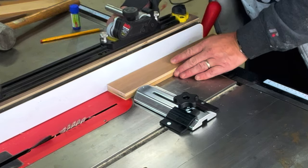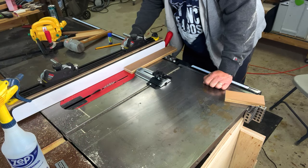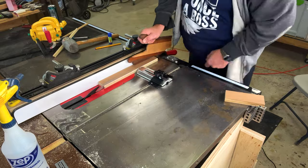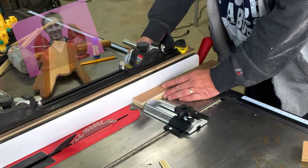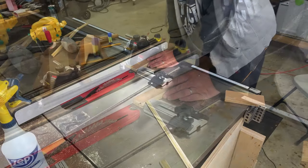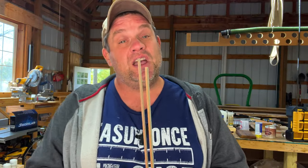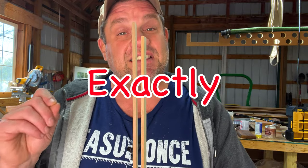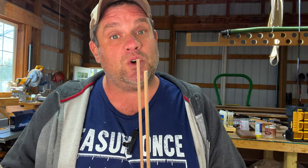To do this, you simply push your fence so the workpiece is squeezed between the jig and the fence. Then you turn the saw on and you're ready to make the cuts. Here's the first cut. Now that we've made our first cut, we place the workpiece back in front of the blade and move the fence so the workpiece is pinched between the jig and the table saw fence — then we can make our second cut. Of course I was cutting into plywood, but when you take a closer look at these two strips, you can see that they're exactly the same width, which is exactly what I'm looking for. This is perfect if you're adding some exotic wood to something like a cutting board or an inlay as a little accent piece.